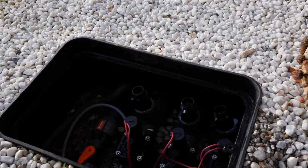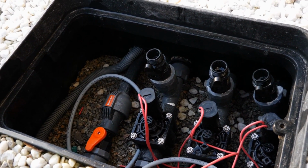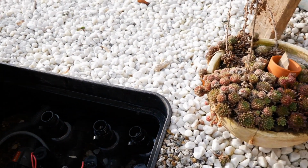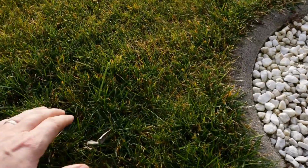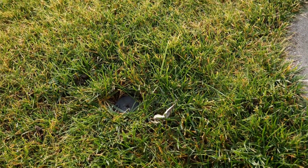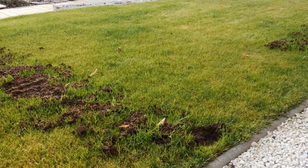In these valve boxes you can now clearly see the valves along with the supply line and more. One supply line runs into the 2nd distribution box, along with cables for the connections and the like. All of that I naturally need for my additional lawn irrigation system, in a new area here. A quick look, this is what a retractable sprinkler looks like, and as soon as it is activated, when the control computer sends the signal, the entire system rises and sprays the area. The entire lawn area is thoroughly watered here.